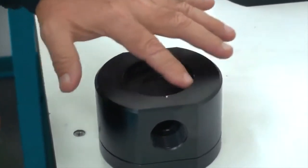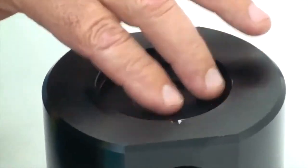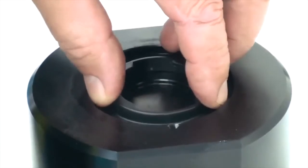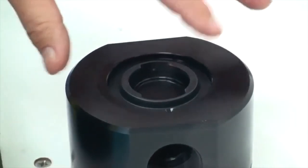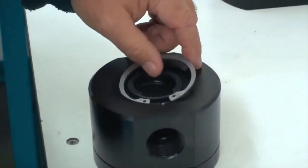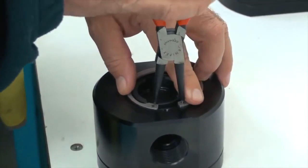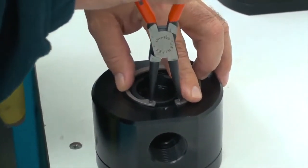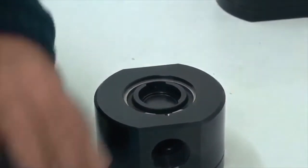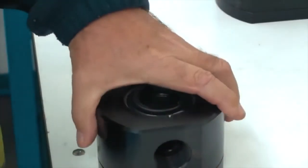This area might need to be cleaned out — some solutions may have crystallized in there, dust may have got in, something that may jam up the electronics or your registers. So we just pull it out, give it a clean, and then put it back in. This is done by getting a pair of circlip pliers, grabbing hold of the circlip, and putting it back into the meter body. That's all in nice and tight and inspected.